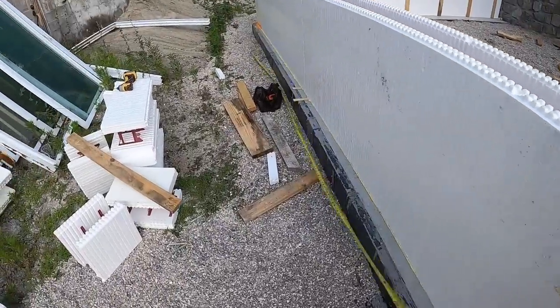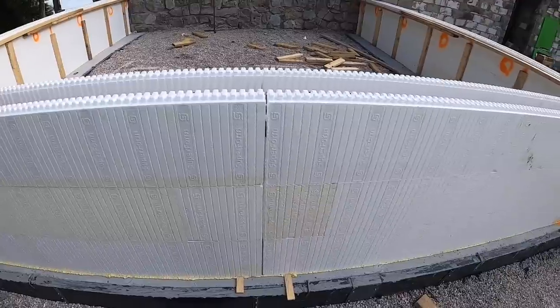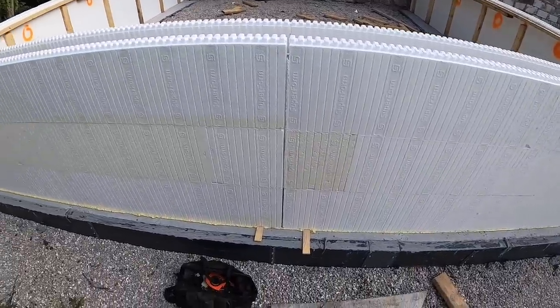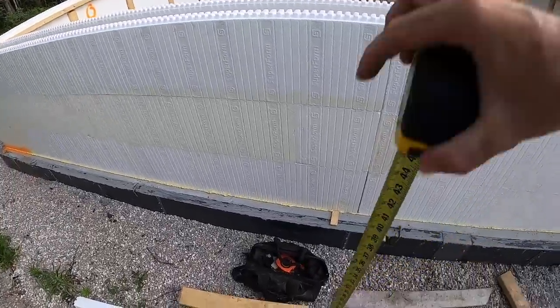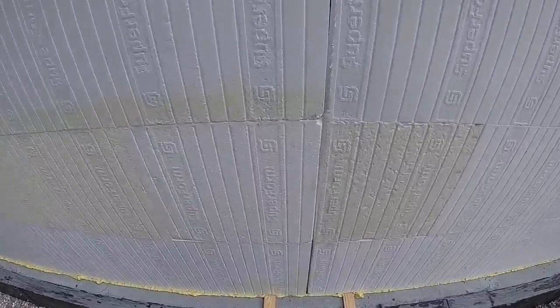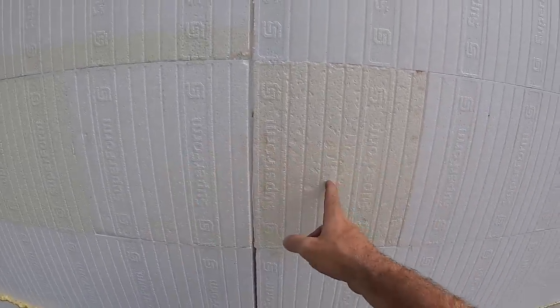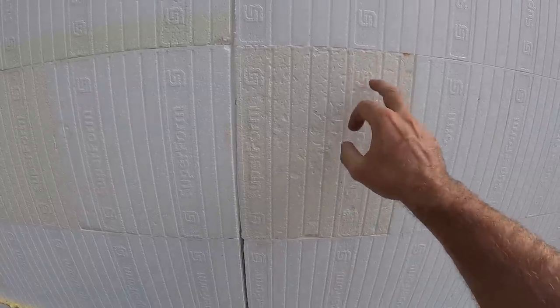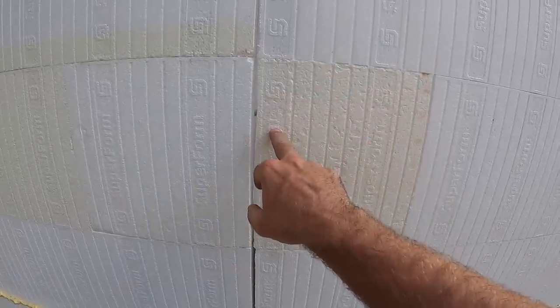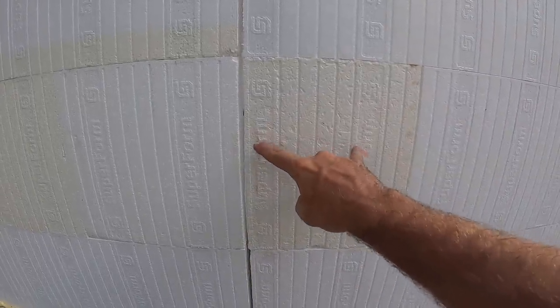And you guys can see there, we are dead nuts on 20 feet. So that tells me that I can go ahead and strap this common, which I could have done already, but I didn't. I used the stiff back in its place. But that ensures that you have your dimension that's needed. And now the other very key thing to pay attention to is, you'll notice here, I've got a short piece. This is what created the common. And the minimum quantity of studs that you want at the end, or when you cut a piece, is 2 studs. That's the absolute minimum.